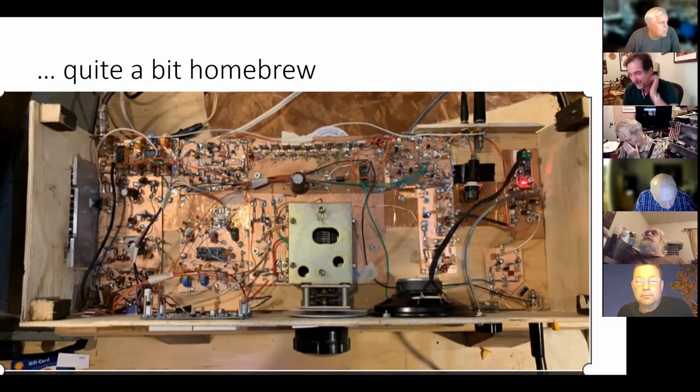In this case, it was good because I would have had a tough time finding a commercial filter at 5.2 megahertz, right? But I wanted a filter at 5.2 because I wanted to prove this Mythbuster concept. Mouser had the crystals at 5.247. I bought like 20 of them and I knew I would use 10. I've got 10 of them sitting in the bag over there. I could probably build another 5.2 megahertz crystal filter if I wanted to.